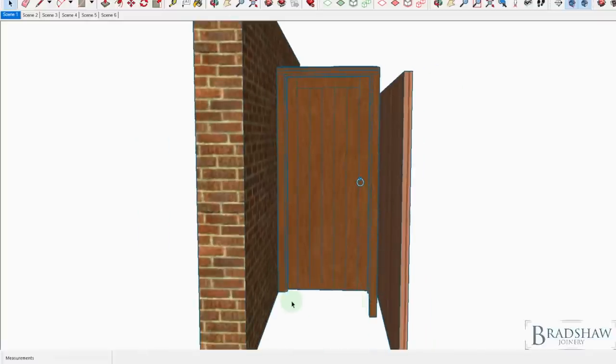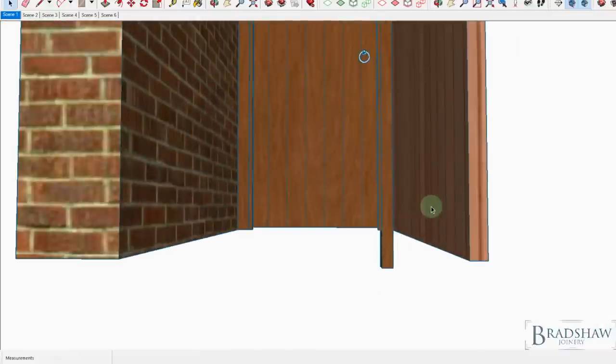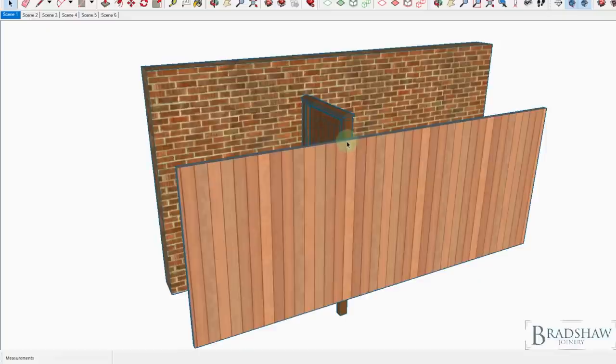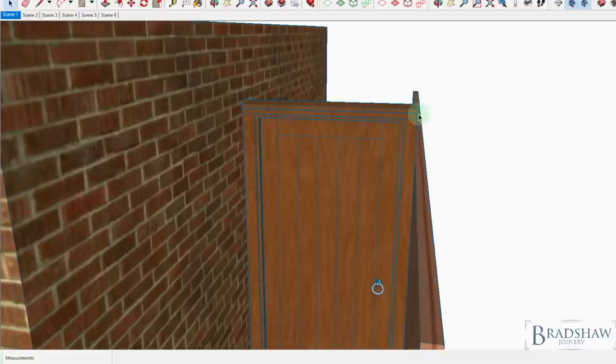It's got a 3x4 frame, so that's a 70x95mm finish frame, and I've got to extend one of them jambs into the ground so it can be a fixing point, because this fence hasn't got much strength to it. There's no posts or anything nearby, so I'm going to extend that jamb into the ground and concrete it in, and I can fix the top from side to side sway onto the fence here, and then the top of the frame will carry some strength through to hold the frame in place.